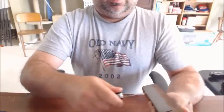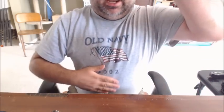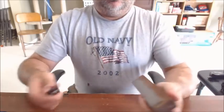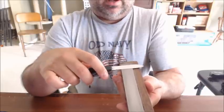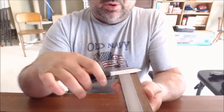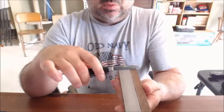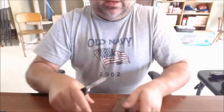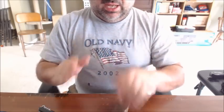The biggest thing to remember is that this is all a practiced art form. Once you do it long enough, you can keep angles — it's kind of like patting your head and tapping your stomach at the same time. The easiest way is to place the knife on the sharpening stone flat, then raise it up to your 15, 20, or 30 degrees — whatever your choice. I usually go about 20 to 30 degrees. You can also progressively roll the blade and get a rolled edge instead of a flat bevel.